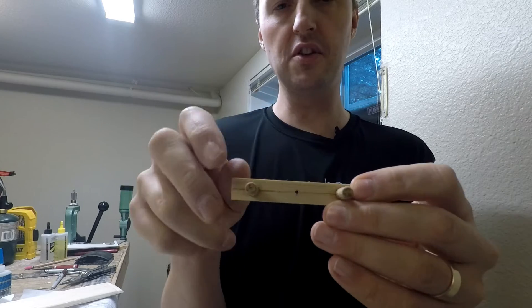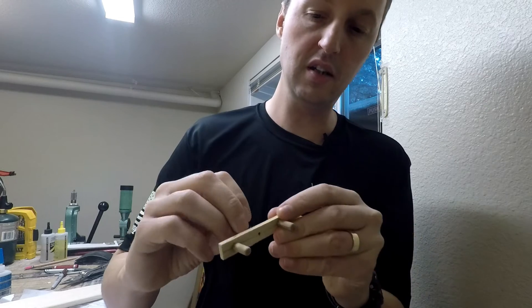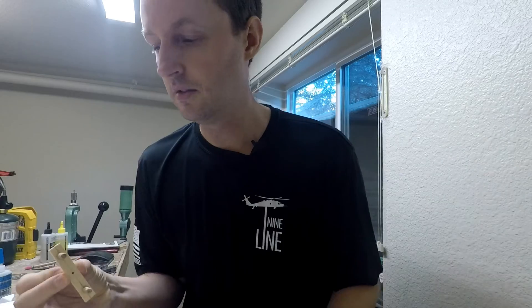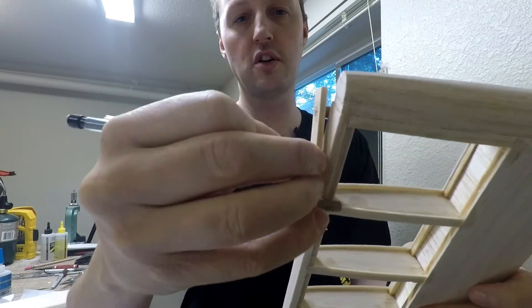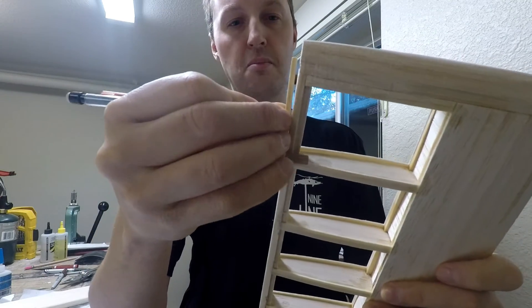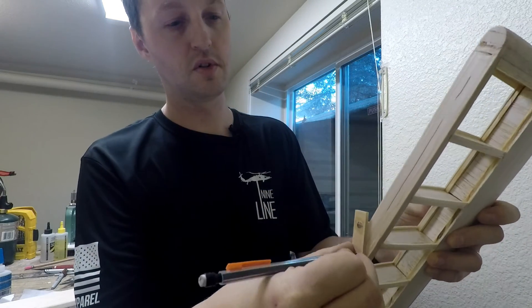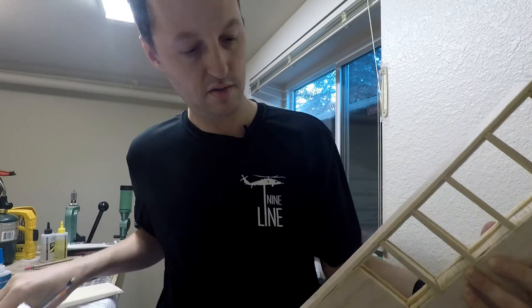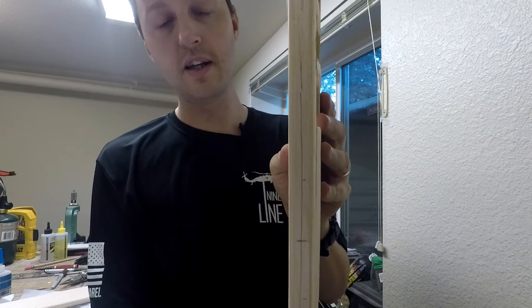The middle hole I started with a 1/16 inch and then expanded it until my pencil fit in the middle. The outer ones are quarter inch holes. You use it by taking the pencil, putting it in so it's just barely poking out the other side, then putting the part on and turning the tool until the pins are resting against the part on both sides. Then you go along and there's a line right down the middle.